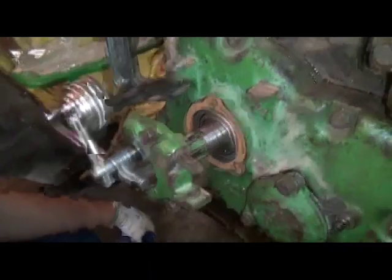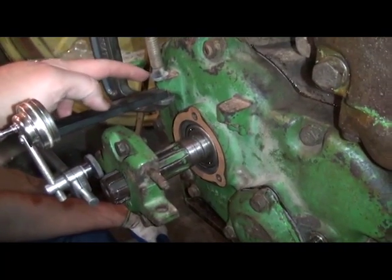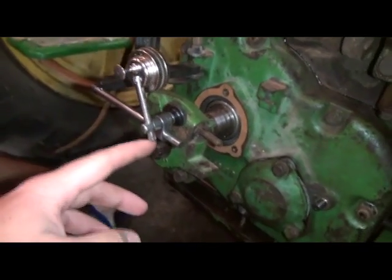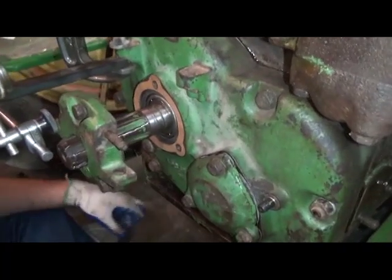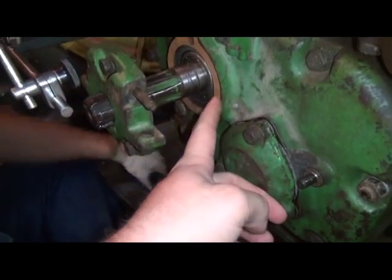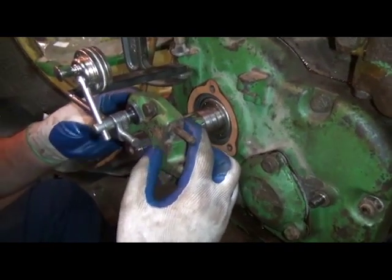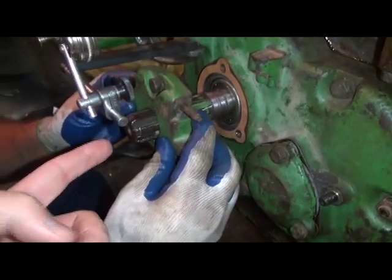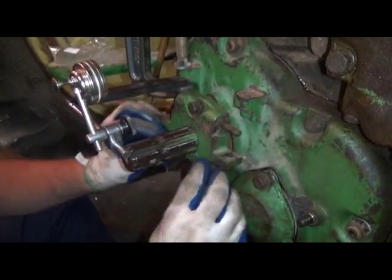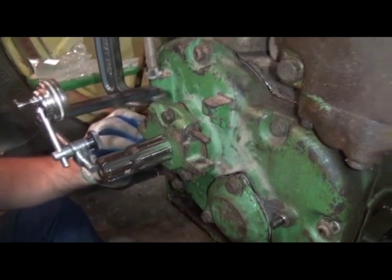Okay, we finally got the power shaft clutch and housing assembly installed, and it was one of those things we realized we didn't have enough hands to do together as well as videotape, so I apologize for that. The gist of it is one person needs to support and get the clutch engaging collars and those little bronze tabs into the collar while operating this arm, while somebody else, sitting on the ground is probably best, lifts the whole housing.